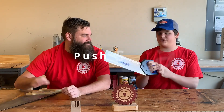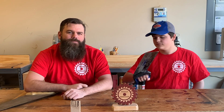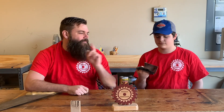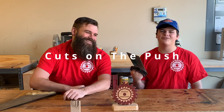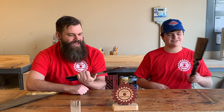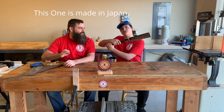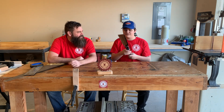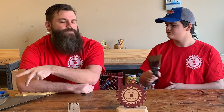And then this one is called a push saw — actually, that one's a miter back saw. This one's usually used in a miter box or something like that. Is that one a push or a pull saw? It's called a push saw — it is a push saw. So this is a miter back saw and it is a push saw. And this one's made in Japan. What does that one cut on? This one cuts on the pull. That's one of the main differences between these two and this one — this Japanese saw will cut on the pull, while the others cut on the push.